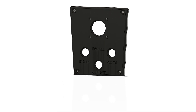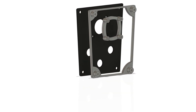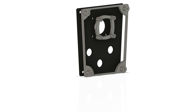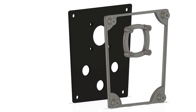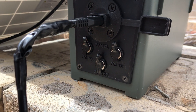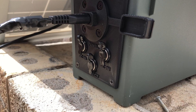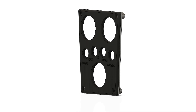For the input panel I designed it again in CAD, but of course you could just drill holes and mount it directly into the ammo can. I designed a bracket that clamps both to the back of the panel and to the SAE connectors to make sure they don't pull out, since it's just thin plastic. The input panel has the input SAE connector for the solar panel, two jacks for other solar panels or connecting another car battery, and one direct input/output that goes right to the battery so you can measure voltage or whatever — and then the same thing for the output panel.